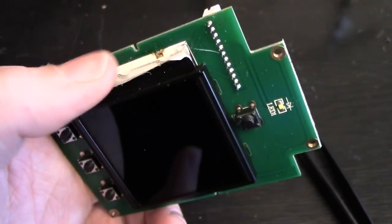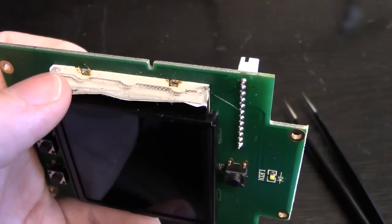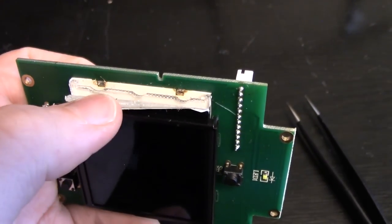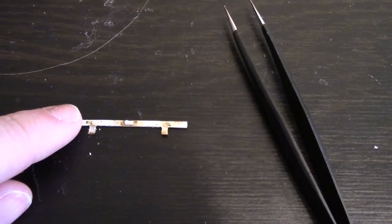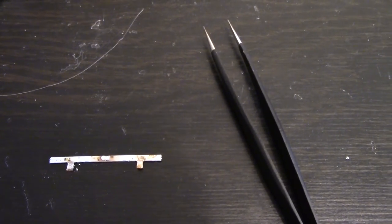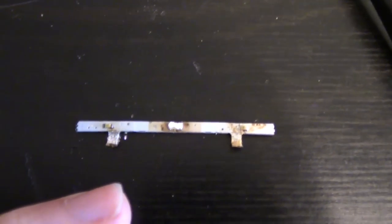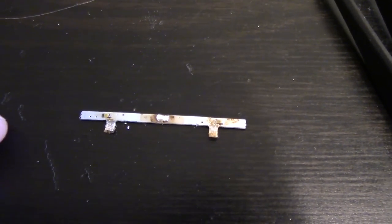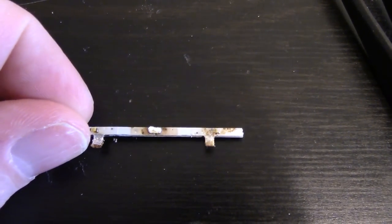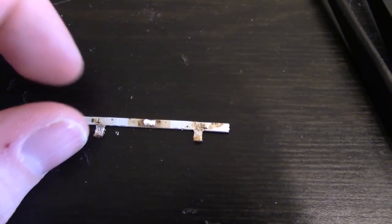I wanted to see if I could retrofit and repair it. What you can do is peel back the reflective film, and the actual LED board is just soldered into these two holes here for the anode and cathode. You can see each of the SMD LEDs goes into where all those little castellations are, and all three LEDs are in parallel. So if one of them kind of dies, they all kind of die — there's no real proper current balancing between them. They should be matched, but that's not always the case after a while. Getting this out is the most difficult part of the repair, because this board is very flimsy and it basically wants to melt. It gets very soft when heated up, and getting the tabs out is very difficult — it's not like a normal lead; it's a tab where the board goes through the other board, and it's a very big pain to get out.